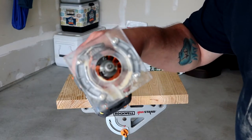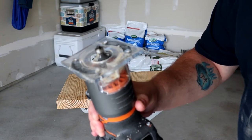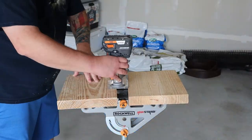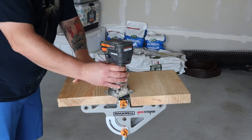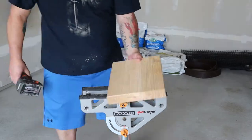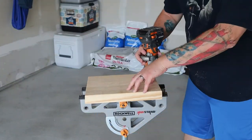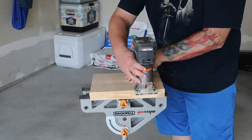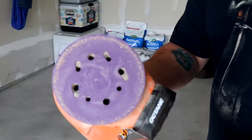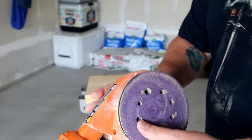So if you're interested in how we created the desk or the shelves, here's an example of what we did to do that. First, I started off with the roundover bit, rounded off all of the edges, and these are just some small shelves that we're going to use on the panels, but we also had the longer ones as well. So rounded everything off, sanded it, wiped everything down. Then you can see me taking the torch to scorch it. Then I wiped everything down again.